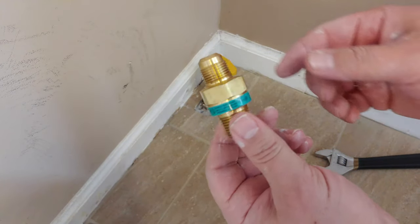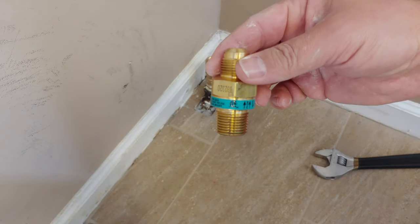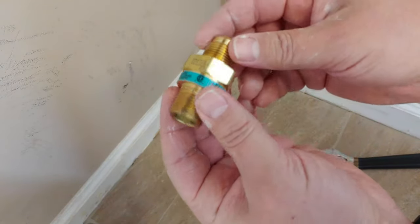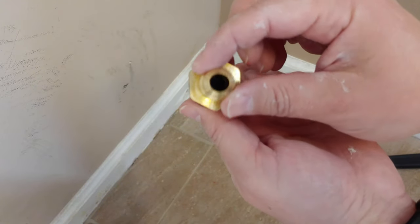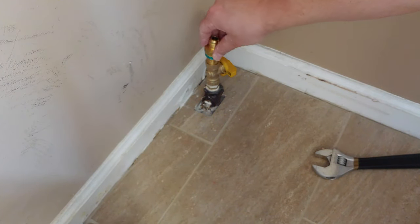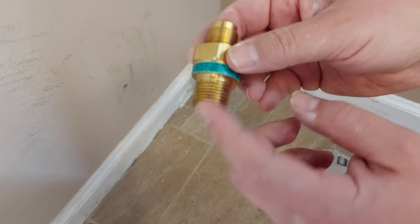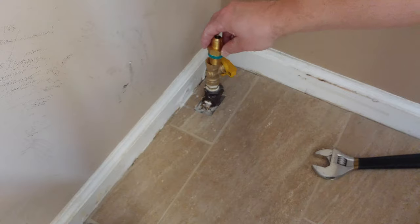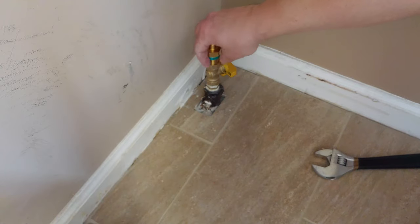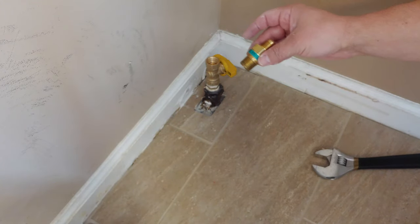All right, from the gas line kit, there is this, what they call the Safety Plus Automatic Gas Safety Valve, because it actually has like a ball valve in it itself. Well, not a ball valve, but there's a safety valve inside of there. So this also has those half inch threads, and this has the proper threads that fit right into a gas ball valve, as you can see. So that screws right in there. So same procedure. We need to use the pipe dope on this. Tighten this down, holding the valve, and then tightening this one down. So let's get to that.